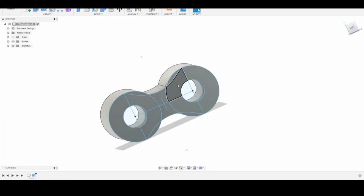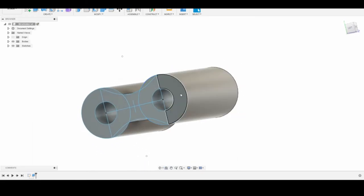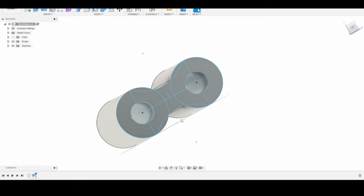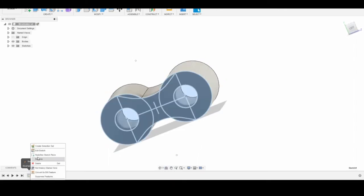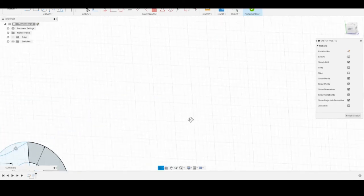And I just gave it a 2 millimeter rim for material and a little slope, and it did not print well. This was too small for the printer to print. Especially when you're working with a 3D printer, you have to take into consideration that your printer has certain specs and you need to work around them. What I completely missed right here was that this big circle was just 2 millimeters, and that takes a lot of precision to ask for when you're working with a 0.4 millimeter nozzle.